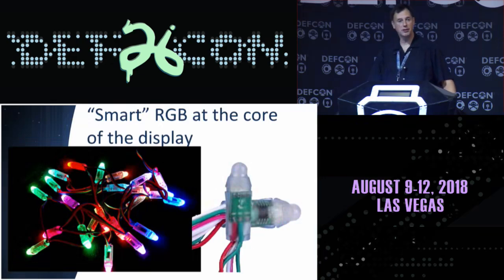So when these pixels first came out, they were called smart RGB as opposed to just RGB, because what they had was a small controller chip. If you look inside the one LED that's running horizontally, you can see a black integrated circuit that's mounted there to control those three LEDs. It takes an intensity for red, an intensity for green, and an intensity for blue, and converts those digital values out to the intensity of the LEDs. So the smart LEDs let you send a command to each pixel and change its color individually.